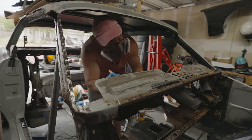Once I got done drilling all the holes, I pretty much had to sand everything down, grind out all the little flares and things that would pop out from the holes, because there was a couple spots where I just had to use a hand drill. And I just wanted to clean it up so that way I could actually go ahead and spray it with some paint. Now spraying the paint, I just ended up using another coat of Steel It.